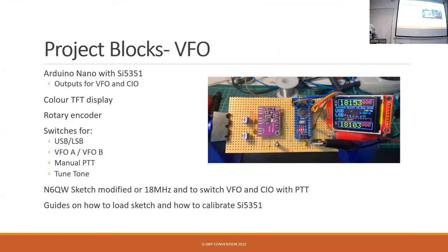Here's an example where Veroboard or matrix board comes into its own, because you've got the Arduino Nano and the SI5351 breakout board. If you just treat them as if they're ICs — forget all the gobbledygook about microprocessors — it's just a blue one and a purple one. When you put them together, you get a digital VFO coming out. You've got a portable display with clean VFOs, USB/LSB selection, manual PTT, and a facility where if you hit the switch it will send out a tone for 10 or 20 seconds so you can tune the rest of your rig.